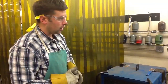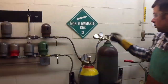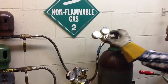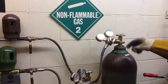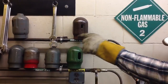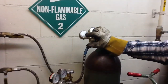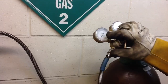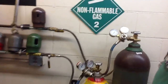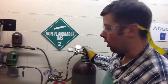Right now everything's off. The first thing we're going to do is turn our gas on. If you're the first person to weld for the day, you're going to turn the tank on at the tank. Make sure it's got pressure here. Looks like it's got way too much line pressure, so I'm going to dial this out, turn the tank open, and this is how I get the argon to flow into the system. I had dialed this out, so my line pressure dropped down to where it should be, about 20 — actually it could be even less than that, somewhere in the 10 to 15 range for TIG welding. So I've got tank pressure on.